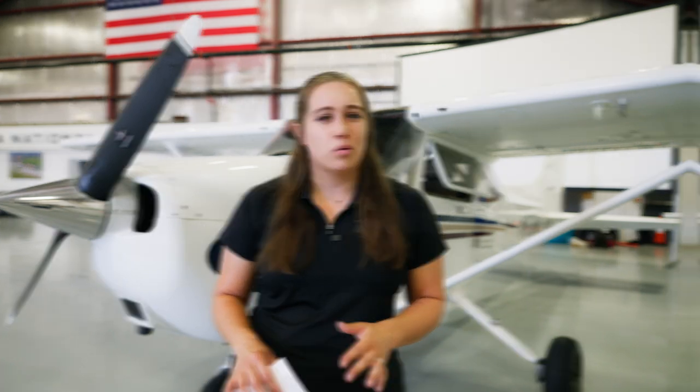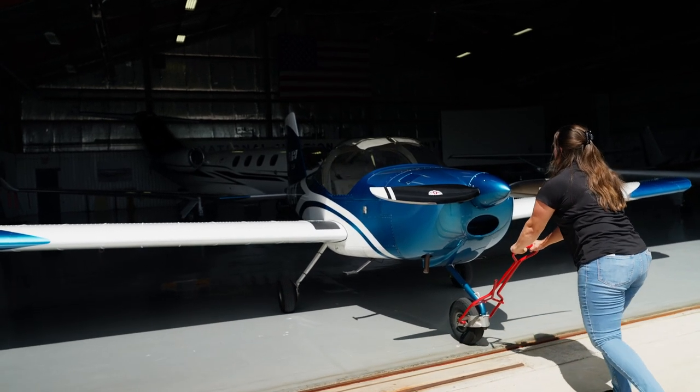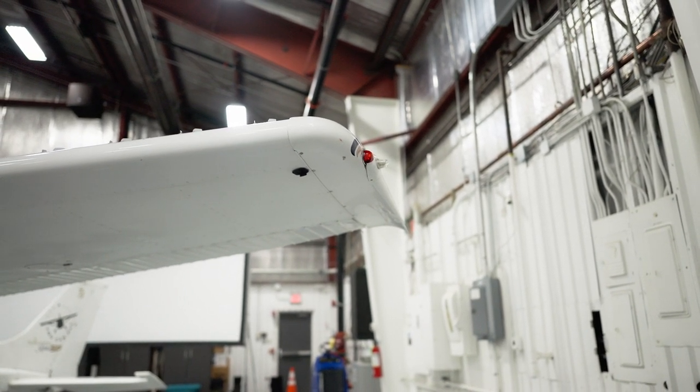Be careful when pushing an airplane. The repetitive motion of pushing and pulling such weight in an awkward body stance could create an injury or build up a repetitive stress injury. When moving a small airplane, you often have limited visibility, especially when moving it into a small space like a hangar. So if at all possible, get a second person on the wing tips to make sure that you have adequate clearance while you're moving the airplane.